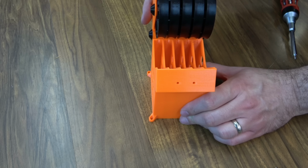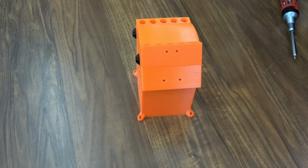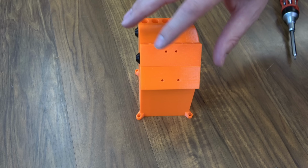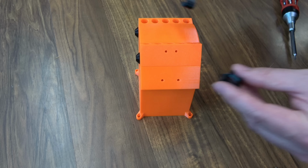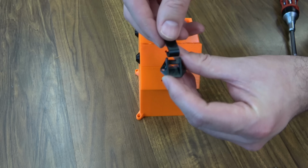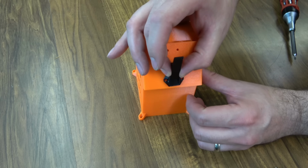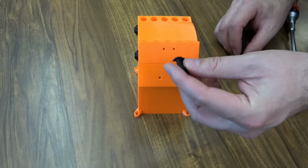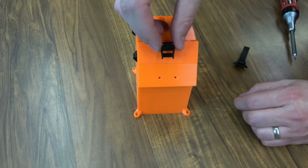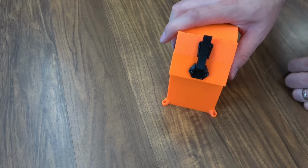So now we have our hinge mechanism. You can open it, check it out, or load it up. It's very convenient. Then our catch lever to keep it closed goes on this side. So it's going to snap up. So the larger hinge piece, we're just going to load that latch. It will screw in right here, M3x10mm screws, and then you have a smaller latch on top to keep it. So it goes right like this. There's the latch pieces on, and then it just closes up like that.